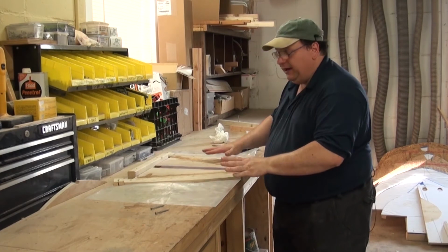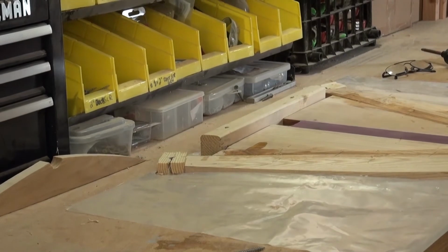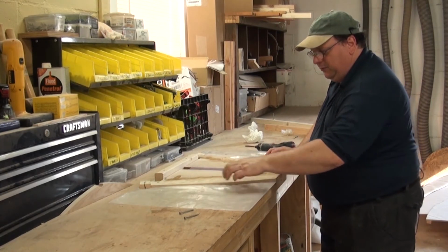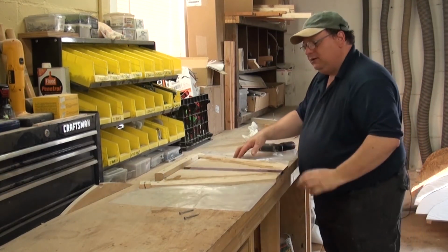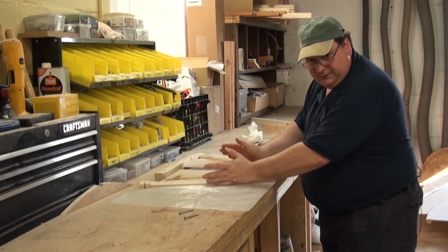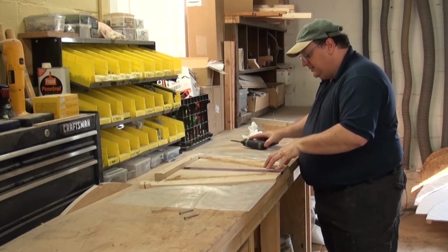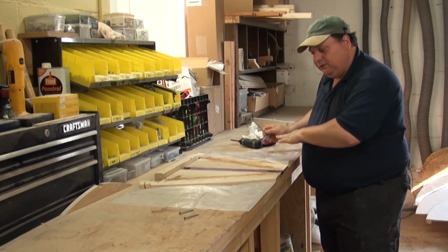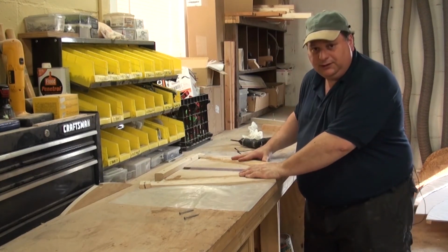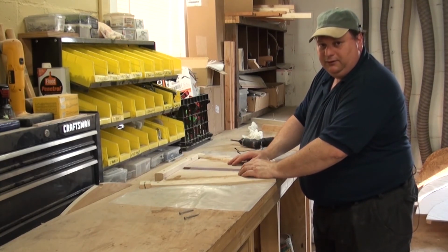Well, we dry fit the whole thing before we got started, and I screwed a piece in here, a piece in here, and a piece in here, and that kept them from sliding this way. And then earlier today I took them out, but I had a small piece here and a small piece here. Looks like we cleaned them up and threw them away, but it was to hold them together this way. All right, so I only put one side in because the other side we're going to push in. And then the last thing I did was cellophane tape on the bottom of the 2x4s going across them all, holding everything down. So it keeps it from going this way. I was able to push them all together, put one screw block here, and we glued it up. And that's how you glue up in a regular shape.